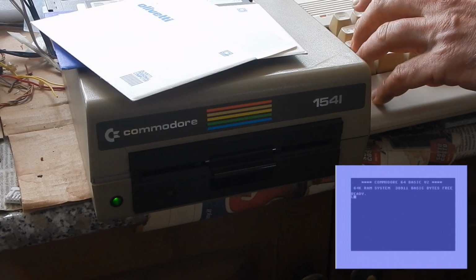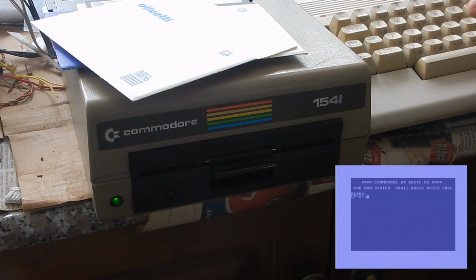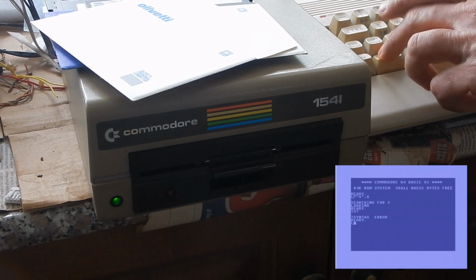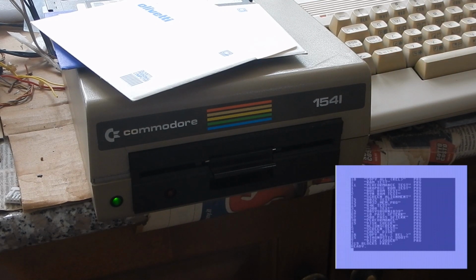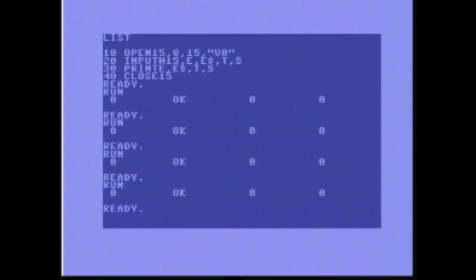And let's see now if the floppy written before can be read in my 1541 drive. The directory loads fine, but let's try something better. This simple program will basically read all files present on the disk to reconstruct the block allocation map, but that's faster than loading every program from disk. I've written 4 disk sides and all of them show no errors.